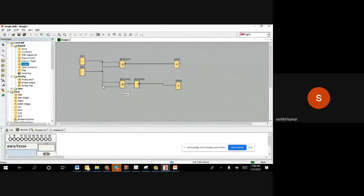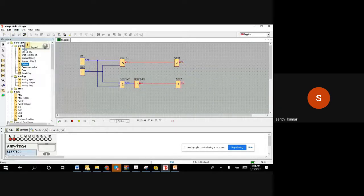So just to visualize that, let us see the result we made this way and see how exactly this matches what we intend to say. So I'm going for the simulation now. If you look, the results are the same for the bottom and top, because, as I said, a NAND gate is a combination of an AND gate plus a NOT gate.